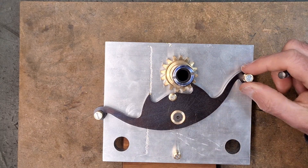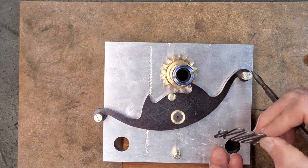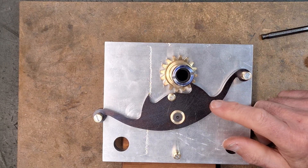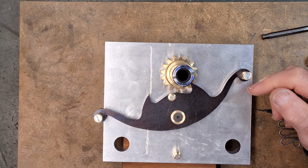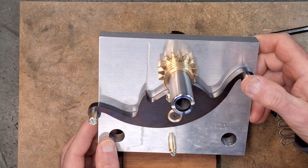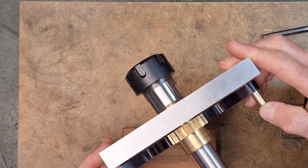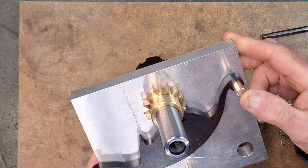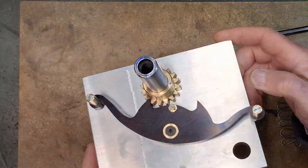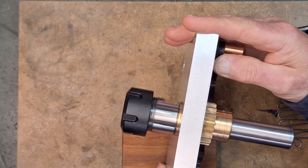A couple of little brass handles attached so that I can switch the ratchet. I've now also got the little serpentine spring which is not brilliant but it does the job. The ratchet pawl itself has been heat blued — just heat it up until it goes blue and then rub camellia oil into it while it's hot to try and hold back a little bit of the corrosion. I did a bit of light finishing with varying grades of abrasive paper. Nothing too much because it's a working tool and I don't want to get too carried away with it — it's got to do its work rather than look pretty.